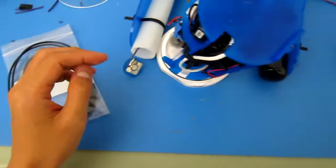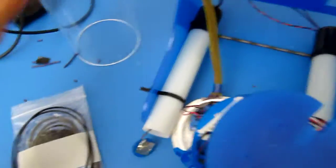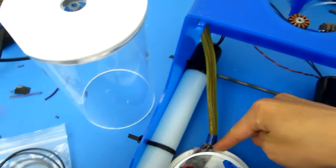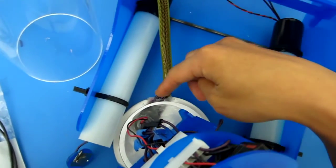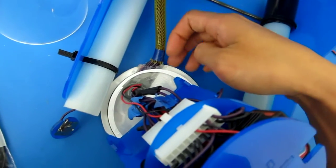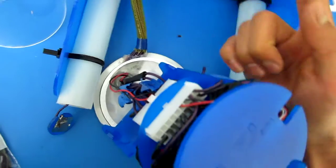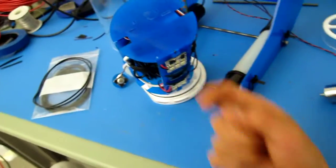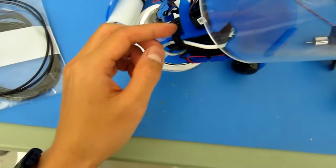So again, let's install and assemble the tube. At the same time, you want to notice where the thick cable exits the end cap. You want that pointing in the upper left corner, like pointing up there. If this is the bottom, the camera should be facing forward towards you. And then just make sure that the notch on this end cap matches when you assemble it over.